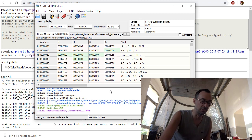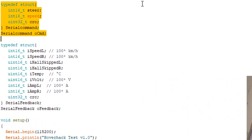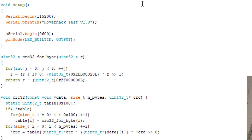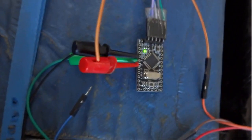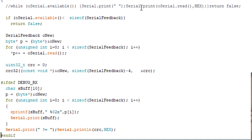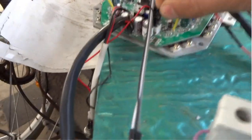This is the controller. For the Arduino code I made a small example file — here we have the structure to send data and the structure to receive data. I have to switch to the Arduino Mini 3.3V. I could not get software serial to work on the D1 Mini ESP8266, so I have software serial at 9600 baud. There's also checksum verification, and here's the receive function. You can download it. As you can see, it's quite error prone.